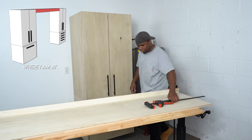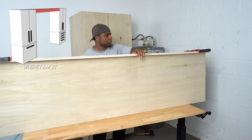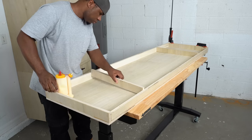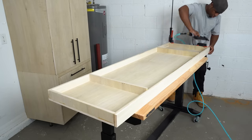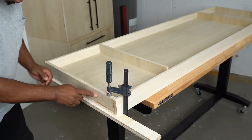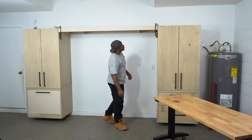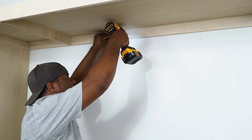Now I need to build a bridge between the two cabinets so I can store bins on the top. To build this overhead storage, I cut down a sheet of plywood that would fit this space perfectly. I attached the strips around the plywood using wood glue and nails. Now that the plywood is framed, I'll attach a couple more pieces on the inside. I'll leave the middle section open for now in case a light is needed in the future. Now I'll add a piece of trim along the front to cover up the end grain from the plywood. When you work alone you've got to always think of little tricks to help you along the way. I'll temporarily attach a piece of wood with a clamp with the lip hanging over, so when I sit this in place on top of the two cabinets it should sit while I secure it. Then I'll drive a few screws through this and into the cabinet, and also along the back wall into the studs.